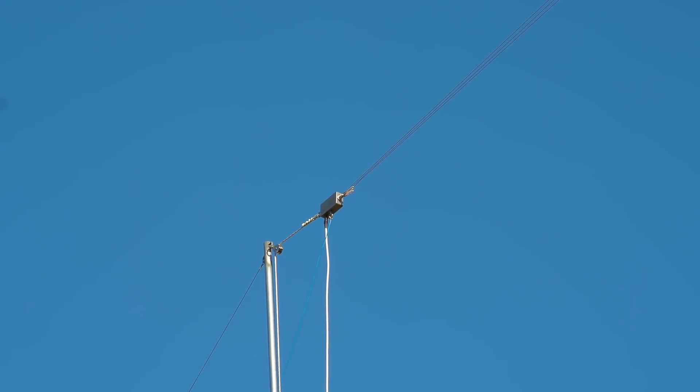Here's a look at the feed point for the antenna. You can see how the three antenna wires fan out from that little loop on the end. It's just an F connector on the bottom and then the center conductor going to that loop on a porcelain insulator. The white lead running down is a coax cable from that box. The pulley on this end is fixed — no spring on this end — because of the ratio at the other end. As the pole bends forward in the wind, since the pulleys are 18 inches apart to the top of the pole, each one of the lines will move at a different rate. The top would move the most, the middle not so much, and the bottom would move the least due to that ratio effect. It is guy wired, but still, to be safe, each one has to have the appropriate tension, and that's all been measured out.